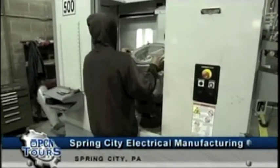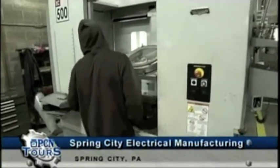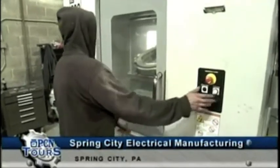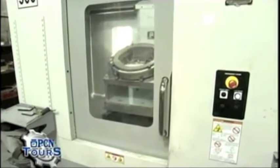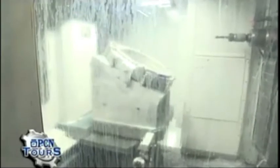Right now we're at one of our four CNC machines. This Haas machine is a computer numerical controlled unit. Right now we're drilling and facing one of our LED lids for our Franklin Square unit. The jig is set up and eventually this piece will go into the adjacent machine while the other is being completed, so we can work on basically two units at once. This eliminates human error — especially important with LEDs, where placement of the boards is extremely important — and also ensures interchangeability.